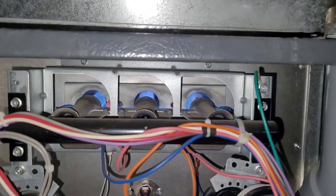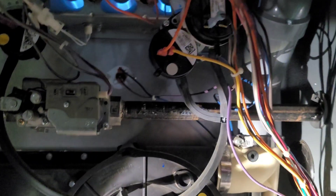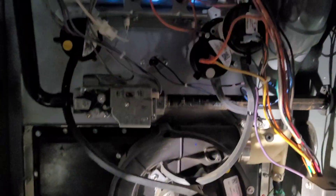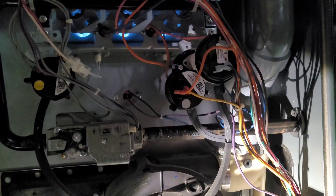It does take some unique tools to get this installed properly, and it's important that you make sure it's opening and closing at the right pressure — you don't want to just guess. Pressure switches are important for making sure the furnace isn't going to produce carbon monoxide, because they monitor the airflow through the whole system and keep everything safe. That's why they're in there.